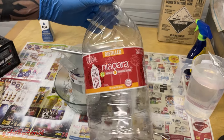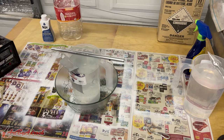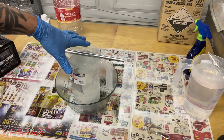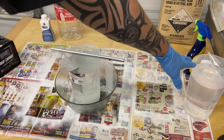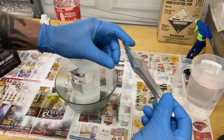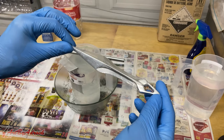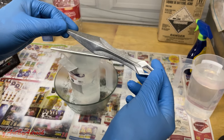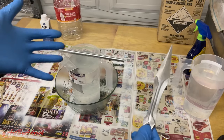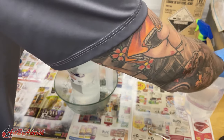First you're going to need some distilled water — you might want to pick up one or two of these — and some battery acid that I already filled up in this jar. This is just plain distilled water to rinse off the part. I'll be doing this piece that you saw on my other channel, and we're going to anodize it blue today. I went ahead and cleaned it up using Simple Green, wiped it all down and rinsed it off to make sure it was clean.